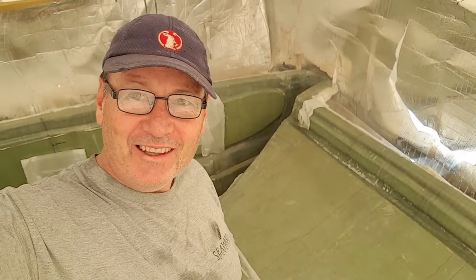We're talking lamination layers and meticulous work, grinding, sanding, fixing voids if you have any. Yes, I could have sped it up with an infusion process, but then there's the risk that I would have messed it up, basically. And I hate saying that, but you know, that's what happens. But I declare, as of today, my hull is now complete. And I've said it a few times, but then I find another little bit. I've been working meticulously to get it done. The only final things I need to do is fix where these purlins sit there and on the port side over here, and that's it. It's ready to demold as soon as I put the bulkheads in.